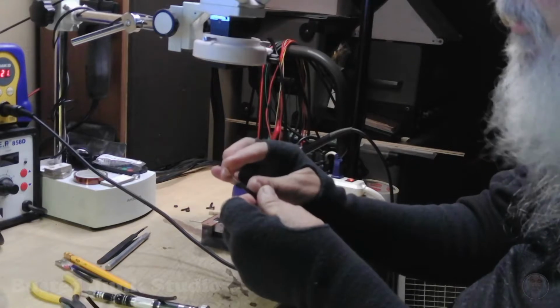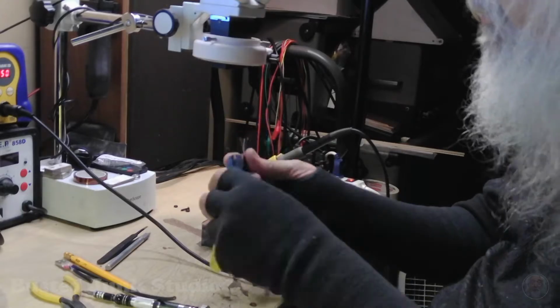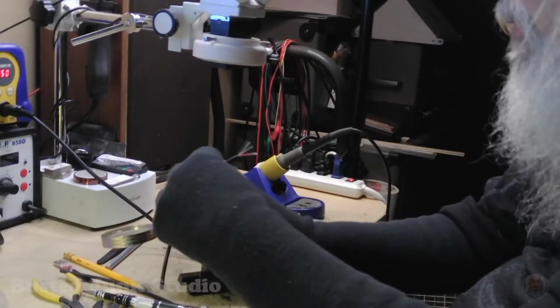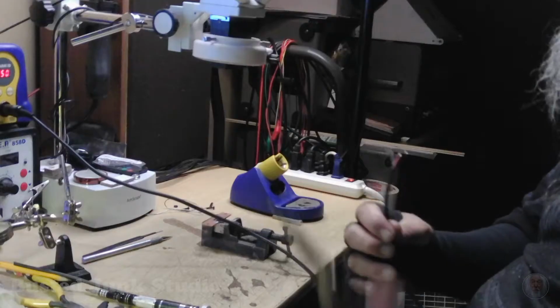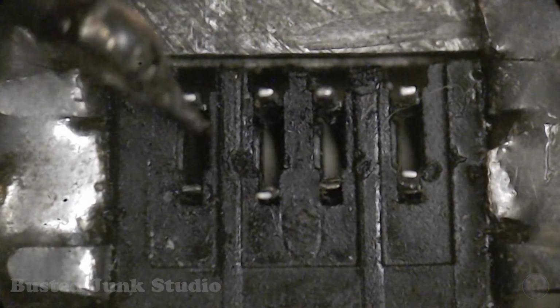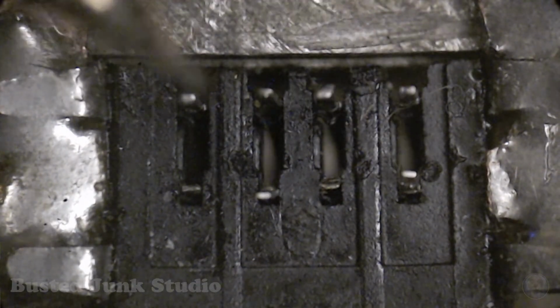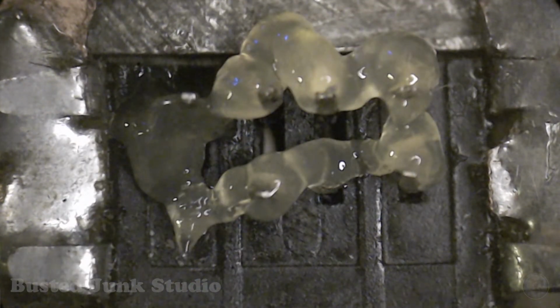and there we go. We expose our red, white, green, black, and bare wires. There's our 5 wires. There's the green, the white, the black, the red, and the metal. Need to strip the ends. Very good. I need to tin the ends of these wires. Now we go to do the hard part here. This is my bogus camera. But what we got here is we got black, green, white, and red. So, and squirt a little flux on them. There's a Louis Rossmann proper amount of flux.